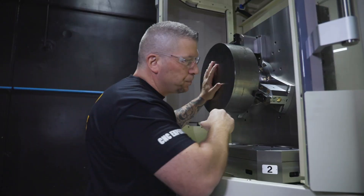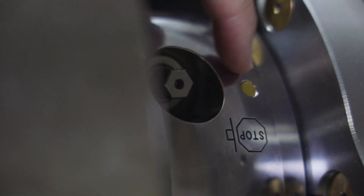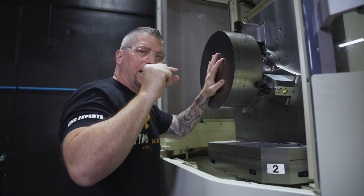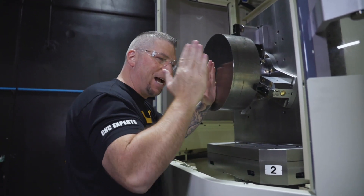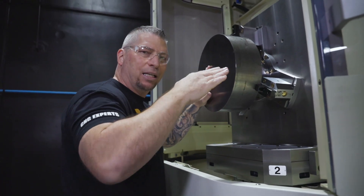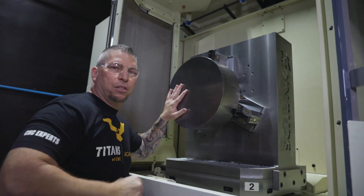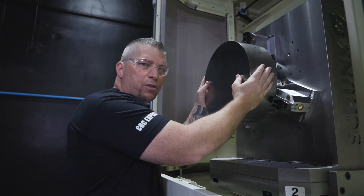One thing I'm super impressed with is the engineering from Schunk on this. There's a gold pin — if you don't torque it correctly the pin will be sticking out of the chuck, but as you go tight and everything is engaged perfectly, the pin goes flush. That means you did it correctly. We've got the material locked and loaded — this is raw stock, so it's always oversized. You had a saw cut this 15-inch diameter, so it's important to pre-op the material.